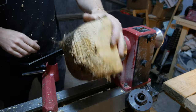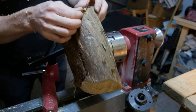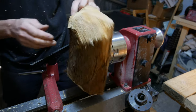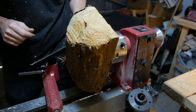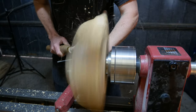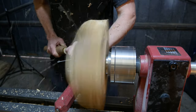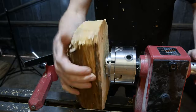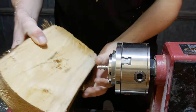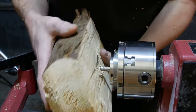You can see how the corners are coming off now and that big bit there that was sticking out has come off. I did speed up the lathe and as you can see it does get a bit easier. What I'm going to do now is just keep going with this until it's a little bit more rounded and then take off the bottom so that's nice and flat ready for our tenon. Actually lost our grip with the worm screw there into that hole, so we're going to switch that to a faceplate and get it back on the lathe.